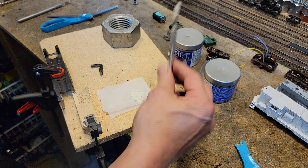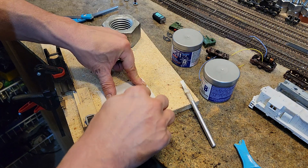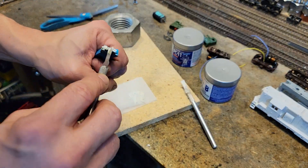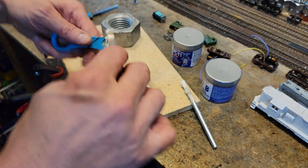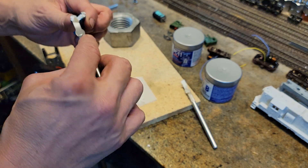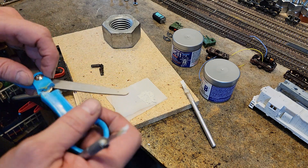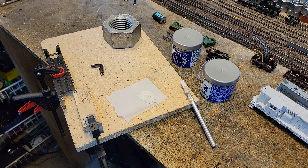I do not trust this guy because he had no hardener. It's gonna be a little more trustworthy with this one. I think we will end up getting epoxy that's already got the hardener in it. So let's take a little test here and put some on the scissors and get the scissors put together. I used contact cement on this and that was a failure. Generally contact cement doesn't fail, but on slippery plastic like this it doesn't always work. Contact cement is great for things where there's a sliding problem on flat surfaces — it's unbelievable. But on things like this, it did not have the strength for the lever action, so we are gonna find out if we can do this with PC-11 epoxy.